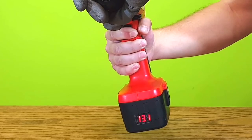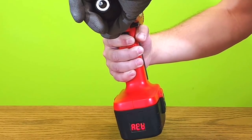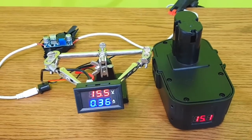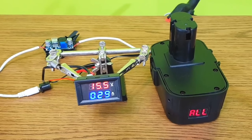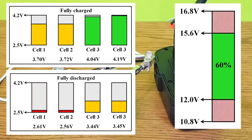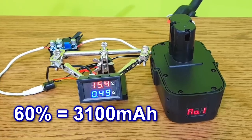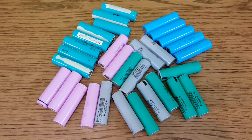The BMS board was not meant for heavily drifted cells. The purpose of any BMS board is to use it with new, already balanced cells and prevent them from drifting apart over time. In general, a BMS board with balanced charging can correct a difference of around 0.2 volts between cells — in those conditions it does a very good job. In a future video I'll show how to make a DIY charging circuit that can balance even old cells of different capacity. The charging process stopped at 15.6 volts, and the over-discharge protection acted at 12 volts. This means I can use only 60% of the battery capacity — about 3100 mAh — between the time when the best cell gets fully charged and the weakest cell gets fully discharged. If you use new high-drain cells it will be the perfect battery.